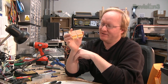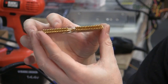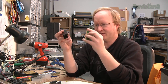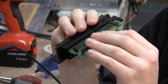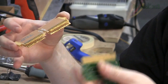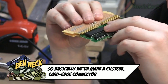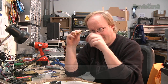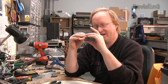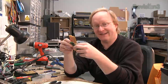Using some perf board and a lot of Molex connector contacts, I have made this new cartridge lock connector. The idea is this will bite down on the cartridge instead of the cartridge sliding into it. Before, the Nintendo crunches it into place. Now what we'll do is these will be open inside the Nintendo — the cartridge will be fed in with a roller, and when it hits an end stop we'll know it's in position. Then a mechanism will squeeze these tight. Conversely, when you release it, these will open up, allowing it to come out. There will be no force when the cartridge enters — the force will be applied by the teeth, not by pushing it into the teeth. In the next episode we'll hopefully get this all mechanically working.